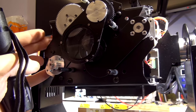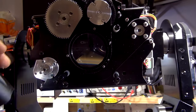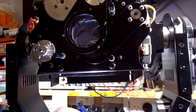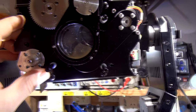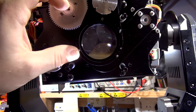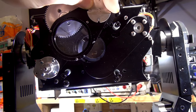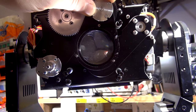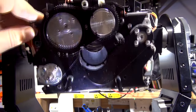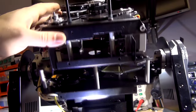They drive together — if you touch one, the other moves as well. That's the shutter. When the prism drops, the ideal center for the prism is right here. But the prism goes a bit further and the image skews. I need to add something to that screw so the prism doesn't go that far — only up to the centered position. Everything else is the same as the other light: the prism rotates and there's a color wheel.